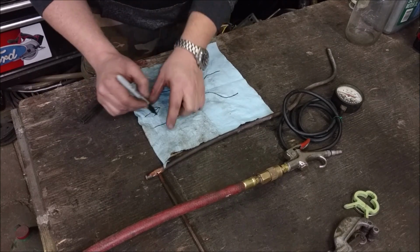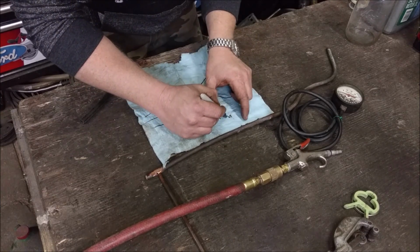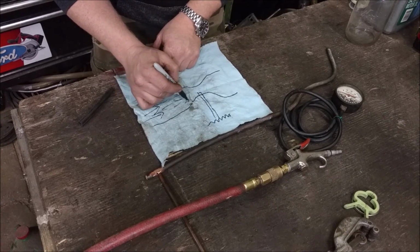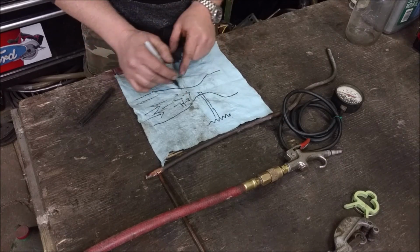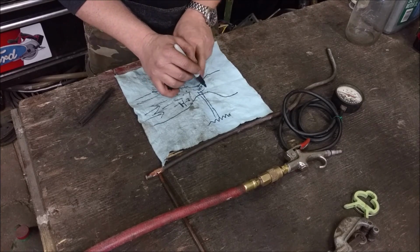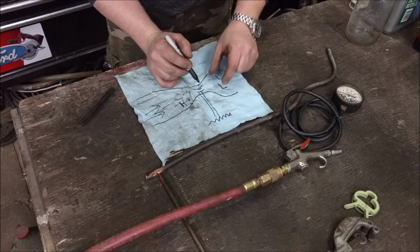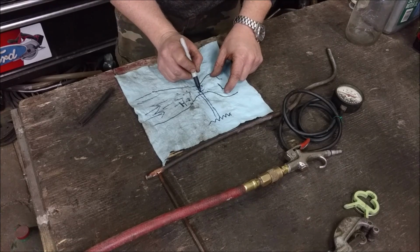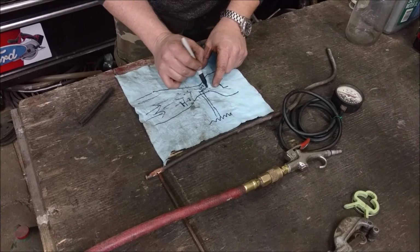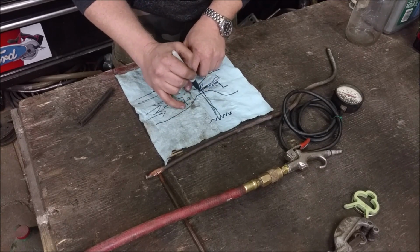So you have the air from the spray nozzle going down here. We have a pickup right here, and we have our fluid. The air sprays into this chamber this way, and it backs up right here and creates a high pressure. It pushes through, it's really tight, and then as it goes right here, it becomes super easy for it to come through, becomes a low pressure, and that is essentially a suction. Anything that's in here, it wants to suck even more because it's coming from here and expanding, so it actually sucks fluid. This is as far as I understand, that could be completely wrong, but it sucks fluid from down here.